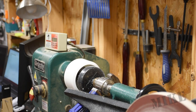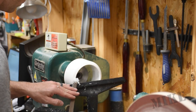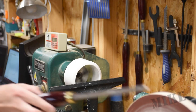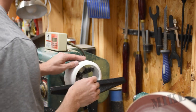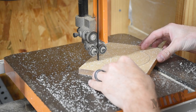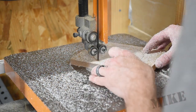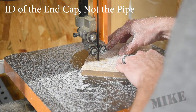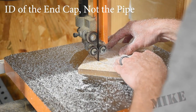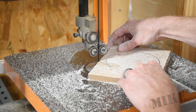There's enough of a lip to hold the acrylic window. I'm using the lathe here to clean this up a little bit and smooth that edge so it's not quite so sharp. Now I'm bandsawing out my hole — this doesn't have to be perfectly circular, it just has to be slightly smaller than the ID of the pipe. I got that pretty circular, I'm happy with that. I'll take the paper off here in a second and test it.